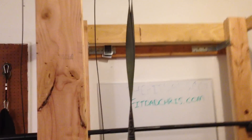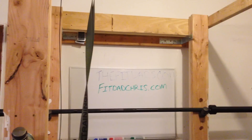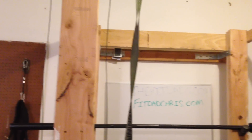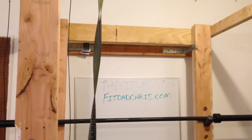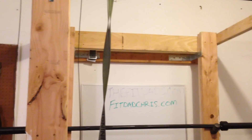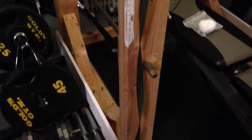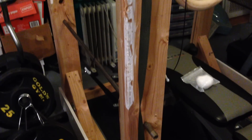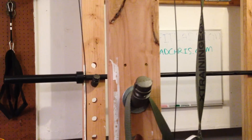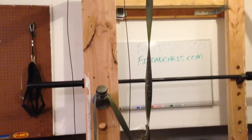Try to pick the straightest pieces of wood you can find. Don't get treated wood — it will shrink and warp on you. I've built a dock in the past with treated wood and that stuff shrinks up big time, and it's more expensive unless you're keeping this outside. For some supports, I went to the culled wood section at Home Depot, which is any wood that has nicks or marks on it. You get it at 70% off, so I got all these extra supports for about $17 instead of $70.